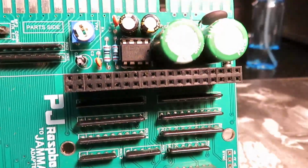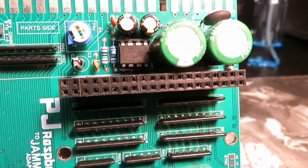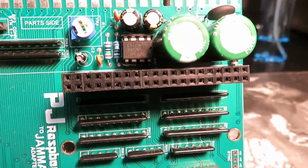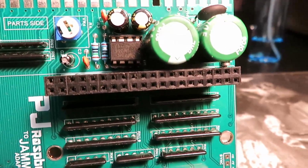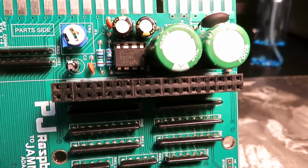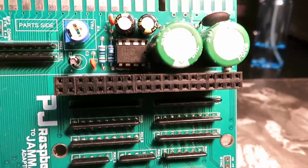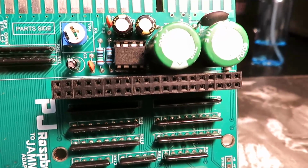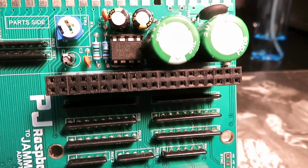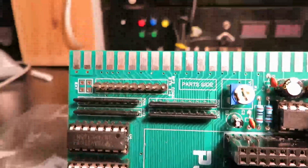In addition to all this, since I was able to develop this interface from the ground up specifically for this purpose, I'm able to do things that would not be normally possible with off-the-shelf hardware when interfacing with the Raspberry Pi. To give you an example, had I used I2C or USB communication, I would be limited to the drivers provided by the hardware manufacturer, but since this was all developed by me with a custom microcontroller and a custom interface, I'm able to take full control of the drivers. Now, of course, that meant I had to develop the drivers by myself, but I'm able to prioritize the communication that is of importance to us. And in this particular case that means prioritizing the inputs from the controls.